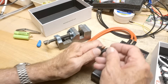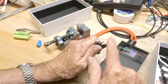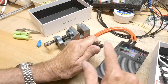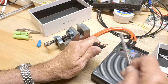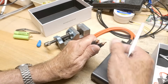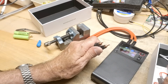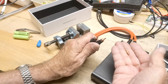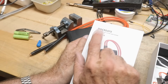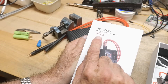One thing from the manual: after spot welding a lot, you might get black marks on the tips, and that's what the included file is for — clean up any black crud so the tips stay conductive. If they wear out entirely, it comes with a spare set and replacements should be available. Thanks to Banggood for sending this in — it's the Do Create TK-10A.